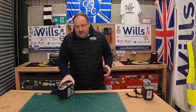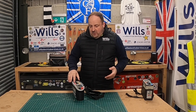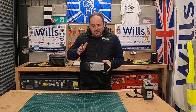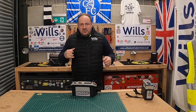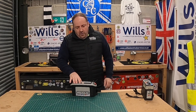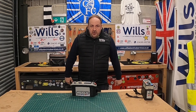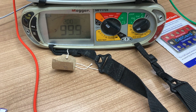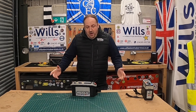This is a 1741, so my other two testers are the 1720s which are very similar, but one of the main differences with this is that it's rechargeable, which I was always a bit skeptical about. I don't really like rechargeable batteries - I was thinking if it's going to leak it's going to wipe out a meter that cost me over £1,200. But this 1741 does actually have the capability to do EV charging. When we took on a new guy and needed another meter, it seemed pointless buying another 1720 when we've already got two, so we went for this one because inevitably we're going to have to start including EV chargers in condition reports.